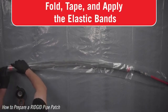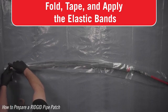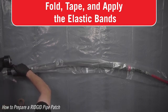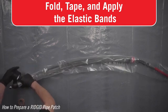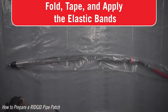Fold the sleeve around the packer and securely tape the packer sleeve at the front of the packer. Wrap the tape around the metal end of the packer, down over the curve of the end of the packer, but do not cover the threaded connection. Wrapping the tape down over the curve of the packer end is important for proper retention of the sleeve in place.